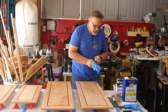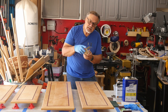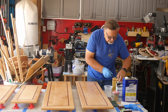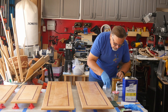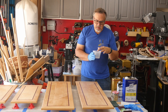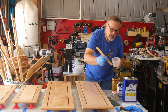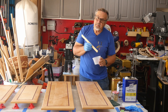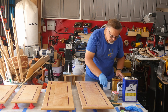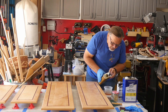I'm going to put the glove on to get ready to do my wipe-on. The tack cloth does leave a little bit of residue on your hand, and you don't want to transfer that over to the wipe-on. This is an old can but I still have some left. If I was using the Danish oil wipe-on poly, what I would do first is put in a little bit of mineral spirits, then pour this amount of poly in and stir it with a stick — that's what the stick is for. You never shake the wipe-on poly because it puts bubbles in it, which are kind of hard to get rid of. I use these old butter tubs and pour in a small amount of finish — this is what I'd use for four doors plus two bigger ones.